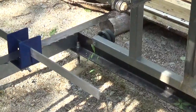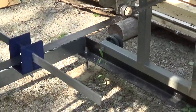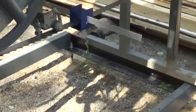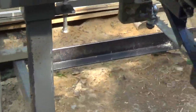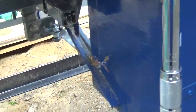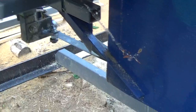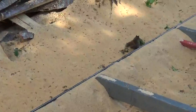If you're thinking of buying or building a sawmill, you should be aware that there's a lot of little mechanical things going on and some setting adjustments need to be made on the blade sometimes - it's not magic. I see a lot of people buying any brand and having issues with blades getting off. You need to make sure that the back of your blade is flush on each wheel before you start milling.